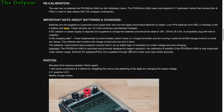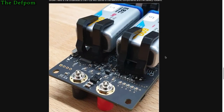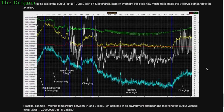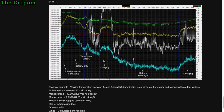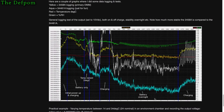Ian has done some really nice work here. There's information about actual testing he's done — various logging, temperatures, and the effects of charging and running at the same time. You can see on the graph where he plugged it into charge — these readings come up a little bit when charging starts. So charging does affect the output reading, which is why he recommends just running off battery if you're trying to do electrical testing. The change is only about 10 microvolts across that range — not a huge change.